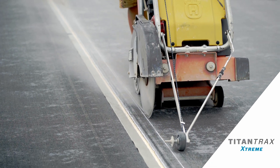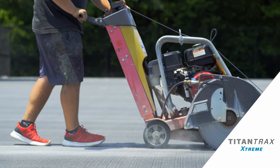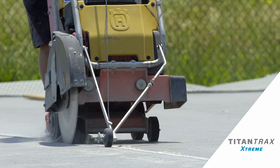After all the panels are stretched, my preferred method to cut the seams is with a walk-behind concrete saw. It's the most efficient because you want to gap the seam in a very minimal amount so that everything lays flat.